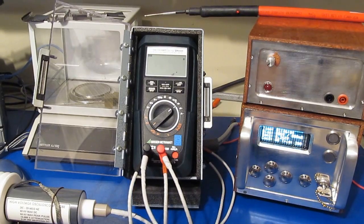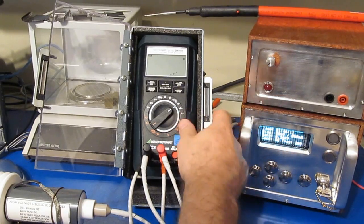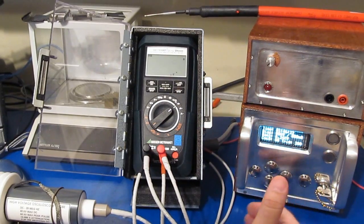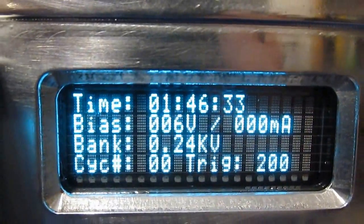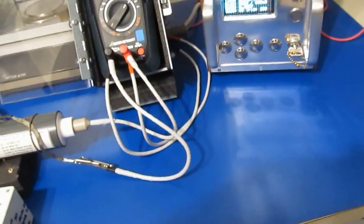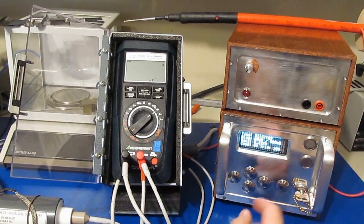One of the comments I'll see from time to time is people talking about how fast I cycle this thing and being concerned that the MOVs are heating up and I'm not allowing them time to cool. I have yet to see a MOV fail in one of these meters - I think this one is rated for somewhere around 70 joules, and I'm typically damaging the meters at less than 10 joules. The transient generator has been running for a total of one hour 46 minutes and 40 seconds so far - just to give you some idea how long these tests actually take to run.